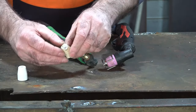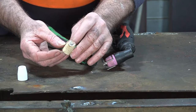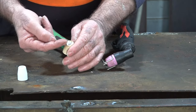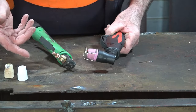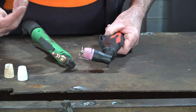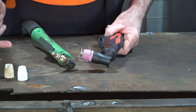Have a look at this one here guys — I've dropped it, and it's hit hard enough to take the corner off. This will never work again because all the compressed air comes out of the wrong side and doesn't swirl around the swirl ring like it's supposed to. The same goes for any sort of torch — doesn't matter if it's branded or non-branded, the principle is the same. They're all going to have a ceramic. Make sure the ceramic's not cracked.